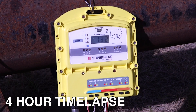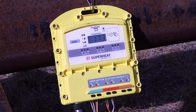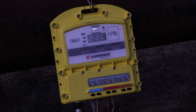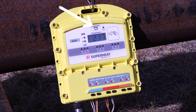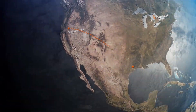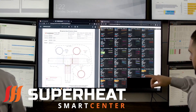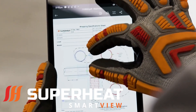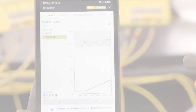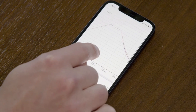On our SmartPaks we have inherent safety devices. We saw Randy swipe that thing and it turns the SmartPak on and allows electricity to flow through to our heaters. Currently these are ramping up to heat. With this white light flashing, we know that we're starting to send heat to this thing. Also, that sends information back to our control room so they can control the heat — whether to ramp it up, keep it in soak, or to start ramping it down. All of that information gets transferred right to the clients real-time, be it on their phone or on their laptop. They always have the data on exactly what each weld's status is and how much time is left on it.